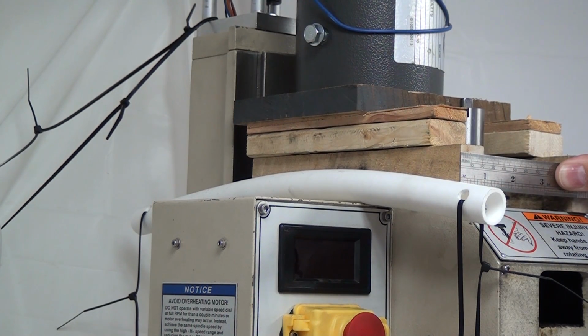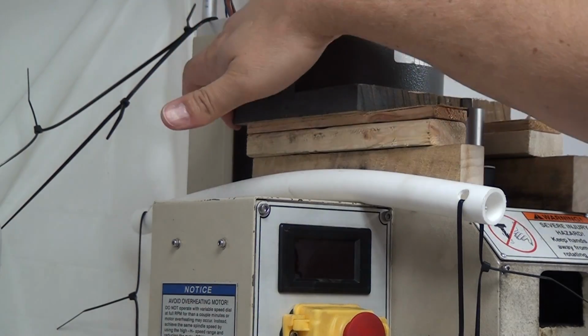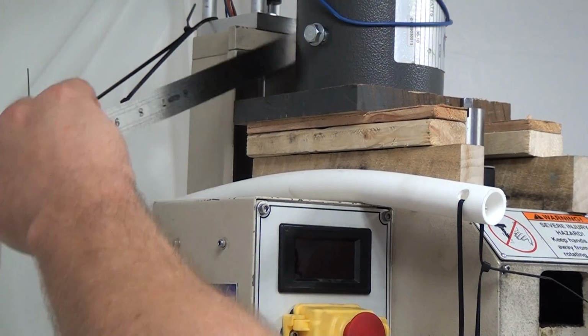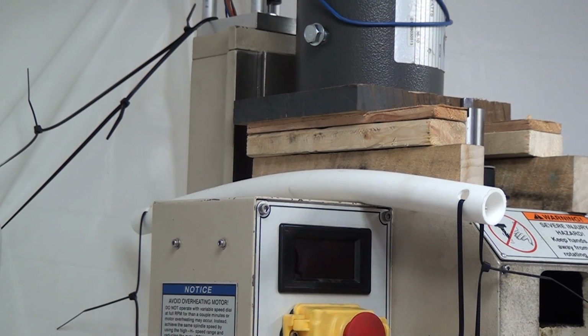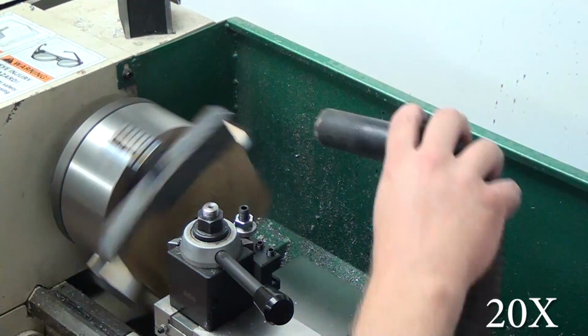I think maybe on my table saw, I have a cheap table saw, I cut these standoffs and then just stacked up wood shims until I got it to the right height. And then I made a top plate for the motor to set in and on, and screwed the whole thing together. The standoffs are drilled and counterbored to be bolted to the head, but then the shims and the top plate are just screwed to that. So the biggest problem was I couldn't tension the belt very much, and that actually caused its own set of problems.